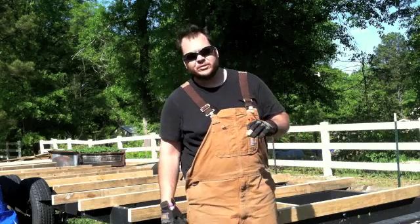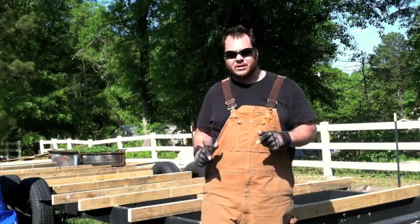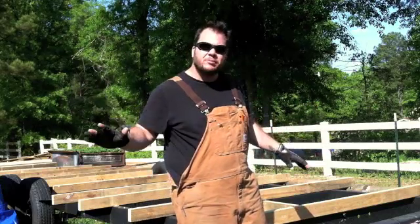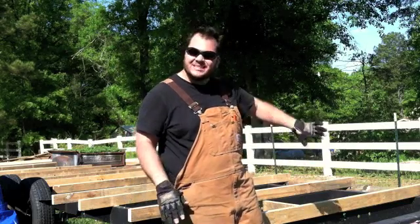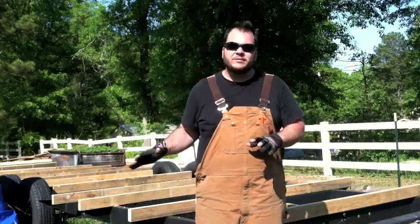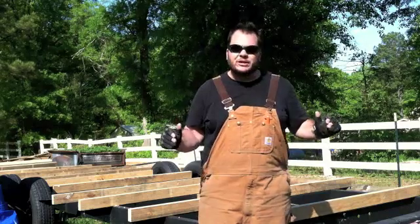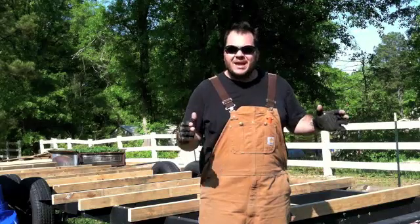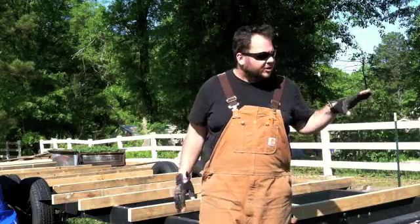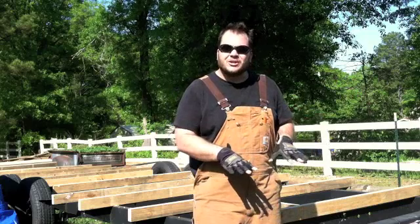We're ready to move on to the next step: adding the radiant barrier. We're using Ecofoil white double bubble barrier. We're going to take all of the joists off and set them aside, keeping them in order since they're all measured and cut for each 16-inch spacing. Then we'll cut three strips of Ecofoil — each strip is four feet wide. Three strips gives us 12 feet total so we can wrap about a foot and a half on all four sides — around the back, the sides, and the tongue area — to secure the foil in place once the joists go back on.